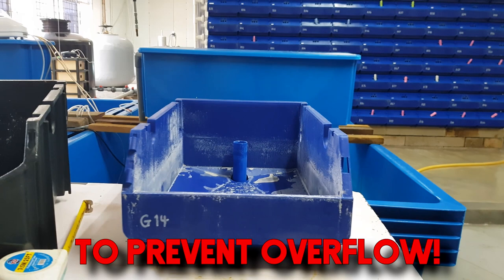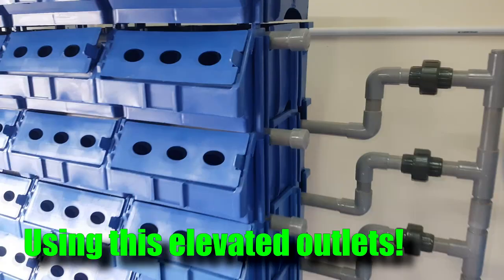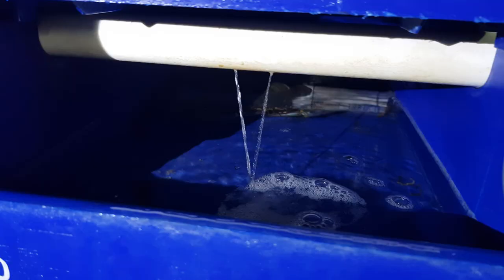Many will design openings that are higher than the standoff pipe. In cases like small boxes which do not have a standoff pipe to control the water level, the water level is actually manipulated using elevated outlets. In this case, the opening height needs to be higher than the pipe elevation to ensure that the water does not overflow from the front.